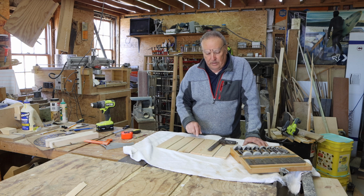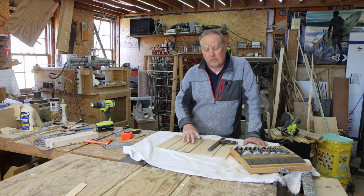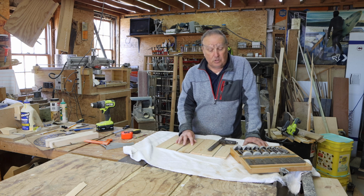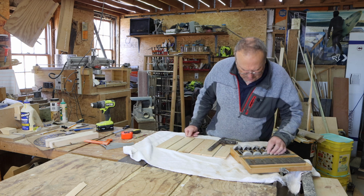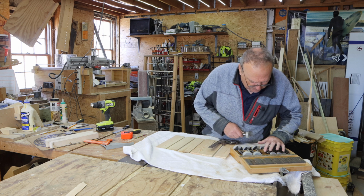And what I have to do here is put a 1 1/4 inch hole, 4 to 6 inch from the bottom, okay? So what I'm going to do, I'm going to put it around the middle, which is going to be the 6 inch. And that way, you know, it's going to be all good. So I'm going to use my Forstner bit here.